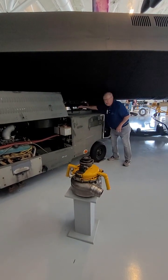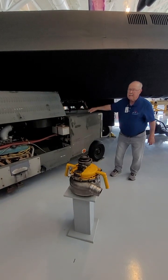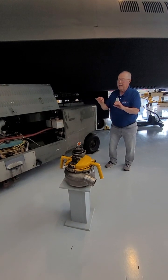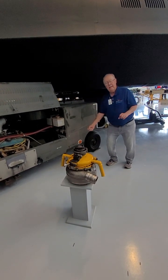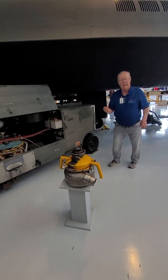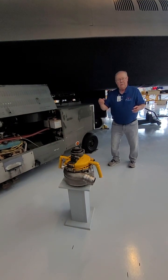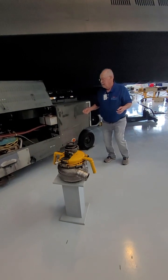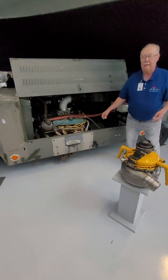On the top of this thing are three little micro switches that illuminate three green lights on the control panel. So when those three green lights are illuminated, the operator now has permission to crank the throttle. The throttle on this thing — there's a single throttle. It's a Morse boat control throttle. We scavenged it off of somebody's cabin cruiser. And that same throttle is attached to both of these four-barrel carburetors.